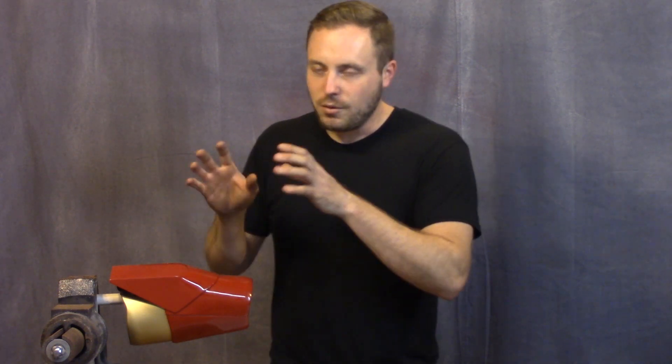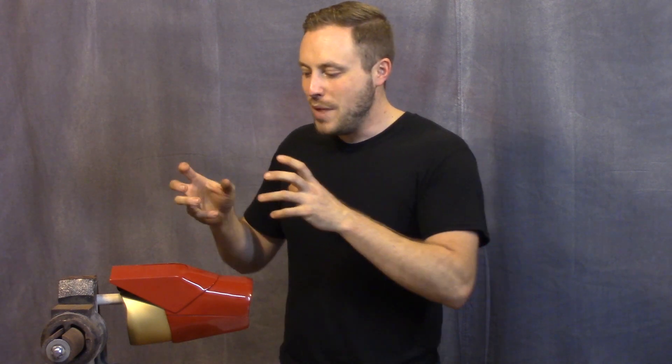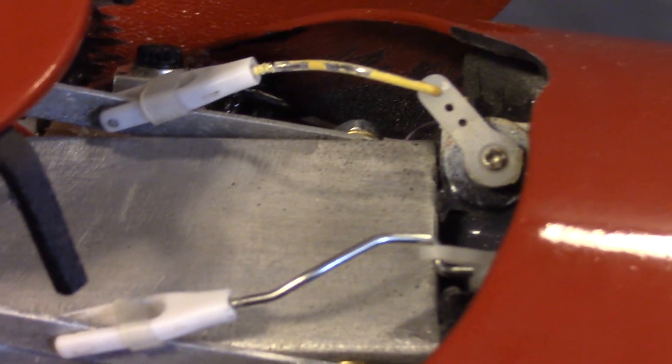There were four things I could think of to fix the movement on the launcher mechanism. First, remove everything and remount the servos to close back to the right position — but I knew that would be really difficult so I decided to wait on that. Second, bend the arms to push everything to the right place, but this aluminum had already been bent and shaped, and clipping and bending it again would probably snap it and compromise the integrity of the side panels.